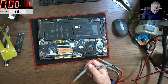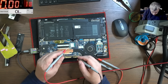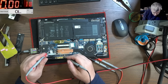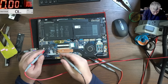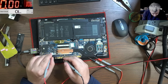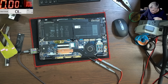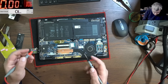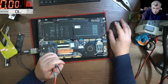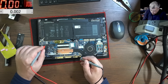Let's plug the USB-C. Same story, but let's see if it's taking power — no, it's taking no power. Let's check the voltage on the main power rail. No current, nothing. Let me switch to volts — nothing.